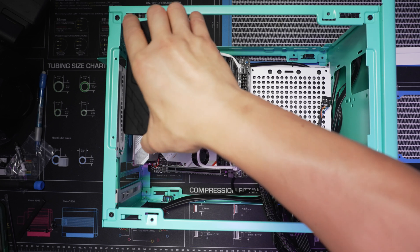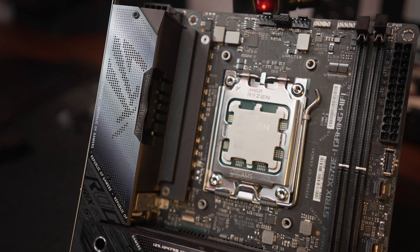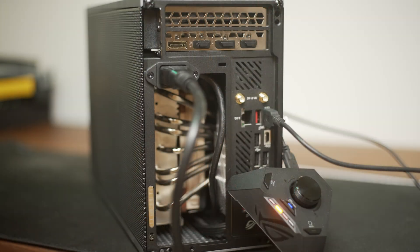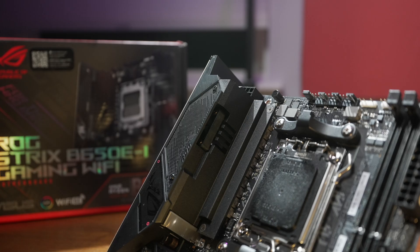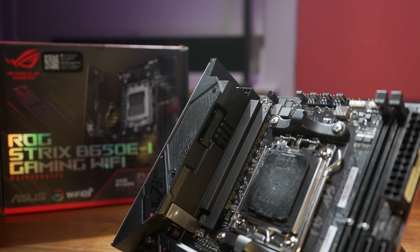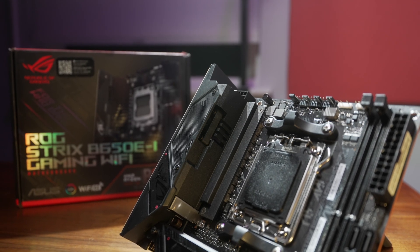Board layout and user experience is a very important part of the equation. Whether you're a first-time or experienced builder, the small things go a long way: minimal cable management difficulties, few obstructions, and easy troubleshooting. Both ASUS boards have a decent layout for headers, but the X670E needs an add-on card for full front panel connectivity and a separate Hive device for debug LEDs — those inconveniences do disqualify it somewhat in this regard.